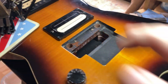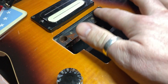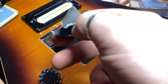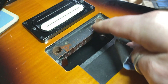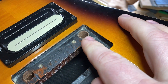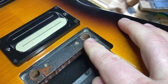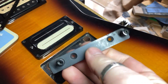We're nearly done. Both are fully dried, fully cured, everything's fully hardened. They've been cut back so they're nice and flush. Just took a bit of 120 over the top — use the pad of your fingers to press into that hole and you get a nice round over on the edge. They are slightly undersized: the interior size of the hole is about 9.85mm or so, which means this is tight to get in, which is good because you want it tight.